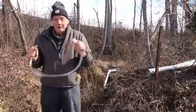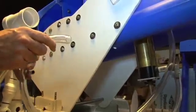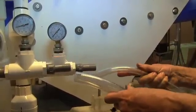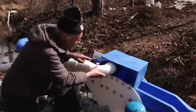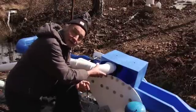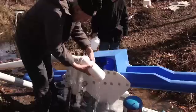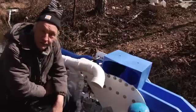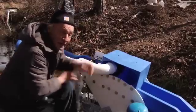Now we're going to connect three hoses within the pump. I like to use a clear plastic hose so when the pump is operating you can make sure that all the air is cleared out, because very often air in the tubes becomes a problem if you can't see it. The piston has two hose fittings, top and bottom — you hook a hose to each, and you hook the two hoses from the cylinder to the two fittings on the valve tower, and it doesn't matter which one goes where. This is the standard piece of hardware that takes the water from the weir upstream right into the machine. Do not glue this in position, because there are lots of times when you're going to want to stop the pump — you'll pull it off so water goes off to the side and you can change hoses. Do not glue it; it will stay exactly where you put it.